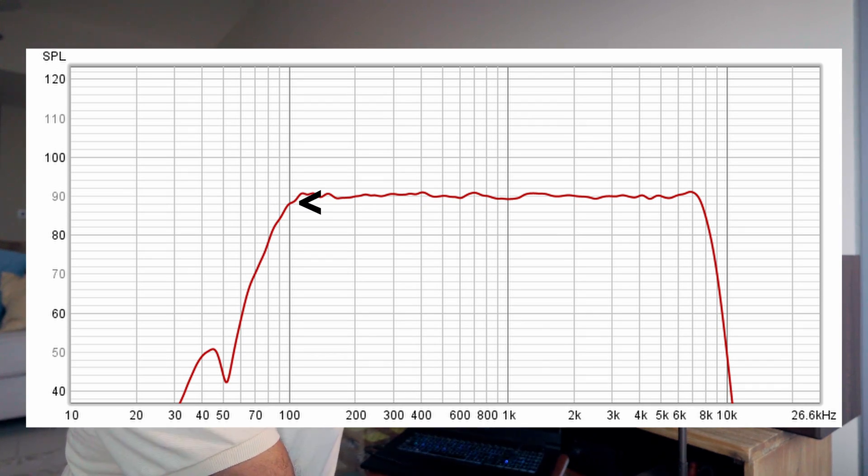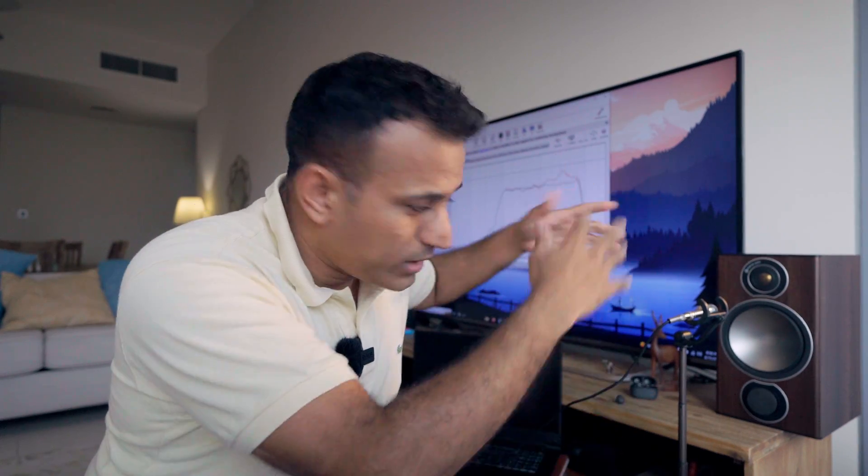From this point on, we can start actually measuring IEMs. This might seem a little jank - I'm using a selfie stick to prop up the microphone - but what's important is just the distance of the microphone to the speaker and the height at which it's aligned. As long as those things remain constant, it's okay no matter how many experiments I do. From the graph, we see this is only usable between about 100-150 Hz all the way up to maybe six or seven kilohertz. Beyond that I don't really get a response, but luckily most of the noise in any environment you're likely to encounter is in that frequency range. So for all intents and purposes, this is a working measuring device right now. We just have to see if it actually works with a Bluetooth IEM in it.